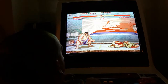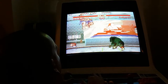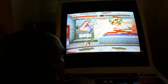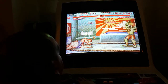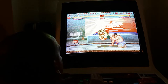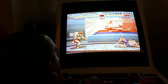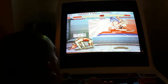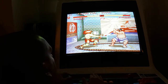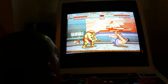Incidentally, I have picked up another board since buying these two, which I'm going to feature on my channel very shortly. I've noticed sellers now actually offer you the option to keep the board as original — unopened, untouched, with the original battery installed — or they offer to install the InfiniKey for you. So on the latest board I got, I asked him if he would install the InfiniKey for me. He did, and the board works fantastic. So you don't have to worry about these batteries. It's always a good idea to remove these batteries anyway on old arcade boards, because the last thing you want is for them to die and leak, with nasty battery acid destroying your board, the PCB traces and things like that, which can take ages to repair.